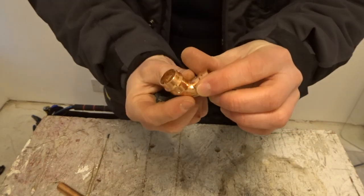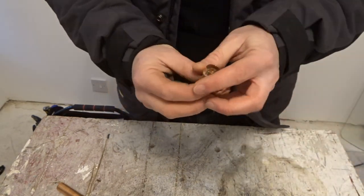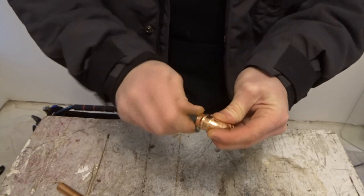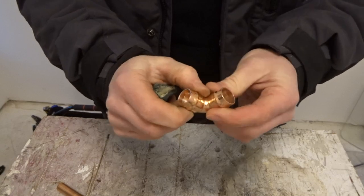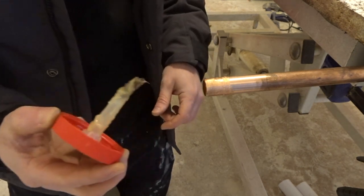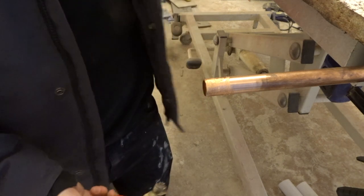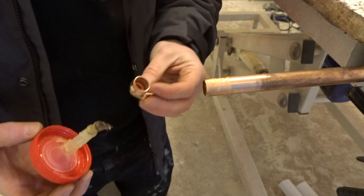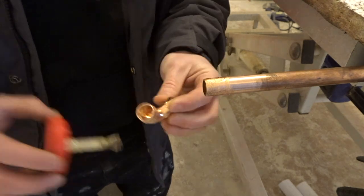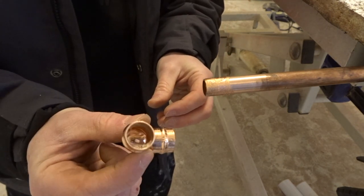It's also important that we prepare our Yorkshire fitting. We can use a self-cleaning flux — it's actually quite easy with these fittings because we can just use the brush inside the flux container. I like to get our pad in there and give that a little clean out inside the fitting, just to make sure there's nothing in there that's going to stop our solder coming into contact with the copper properly. So next, I'll show you how to apply the flux. Make sure you've got enough flux just around the end of the pipe where the fitting is going to go. Also make sure you put a little bit of flux inside the fitting as well — you can see there's plenty of flux in there and on the pipe.